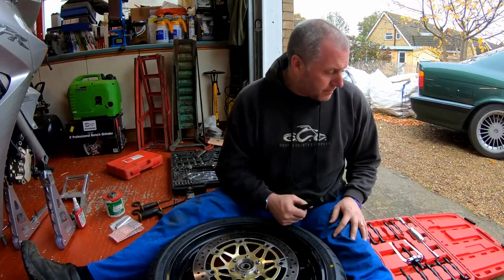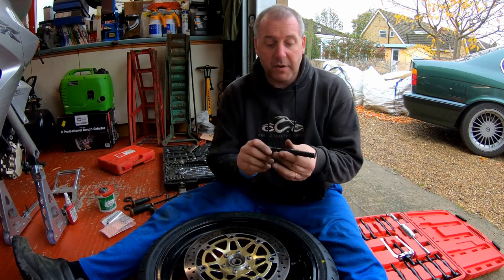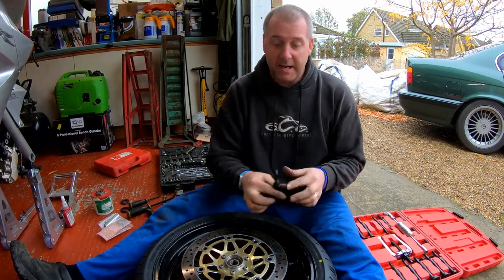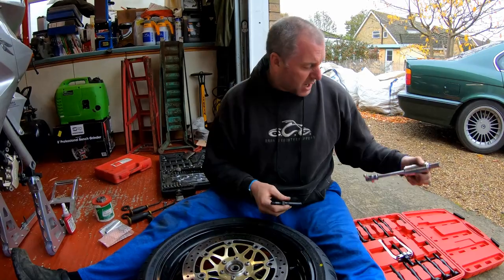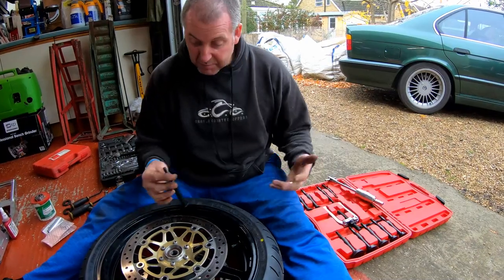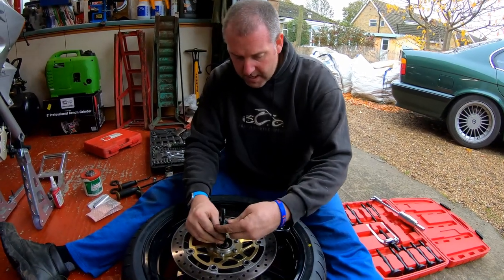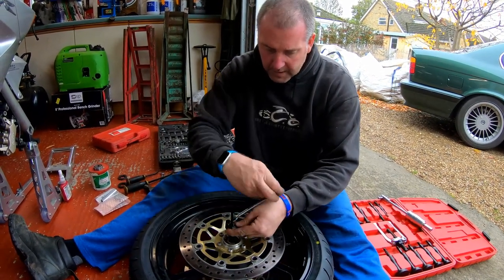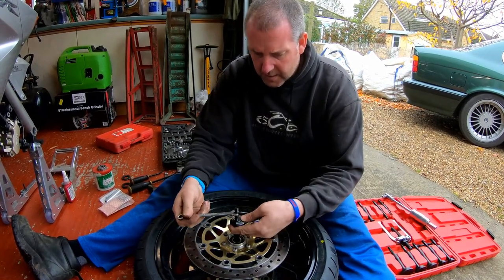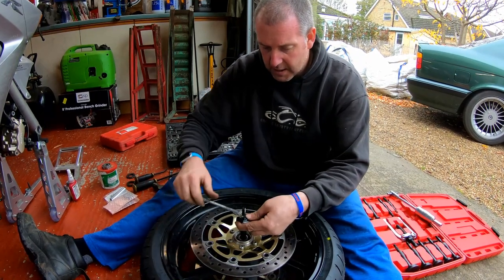What I've got here is a set of bearing pulling tools. All they are is a sleeve with a threaded rod down the middle — as you screw it in you can see it opens up. You put it inside, screw it down, it'll open up inside the bearing and gives you something to pull against. We've got slide hammers and a pulling bridge. What I'm going to try is the slide hammer because it's pretty quick and simple. These are pretty good for blind bearings as well — in engine cases and stuff like that where you can get in behind them, these are perfect for that kind of scenario.